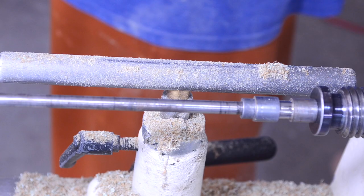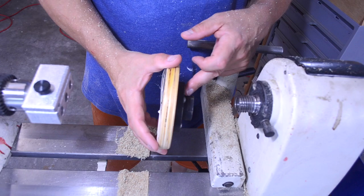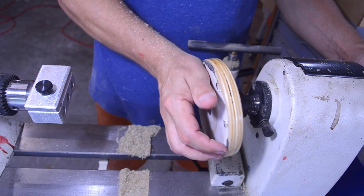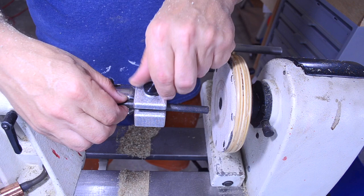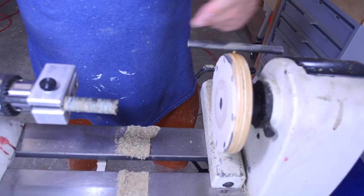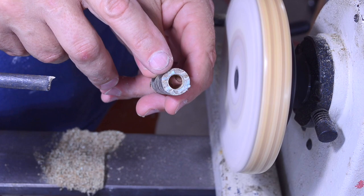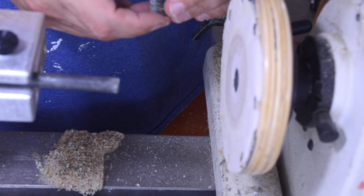This is my number two Morse drill chuck with an offset sanding jig on it. I take off my mandrel saver and put this in. On the tailstock end, there's a piece of three-quarter inch plywood on the backer plate with Velcro and 120 grit sandpaper. Then I get a punch pin the same size as my tube, slide it all the way back into the chuck for stability. I sand it off until I get to the edge of the brass — you can see something shiny and actually hear it. I noticed there were a lot of loose fibers when sanding, which tells me I'll need to stabilize it with thin CA glue as I'm turning — hopefully it will help keep this together.